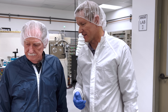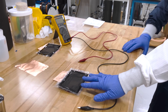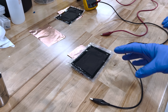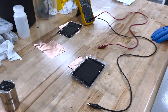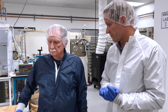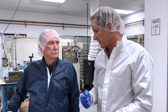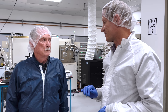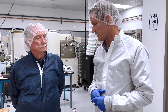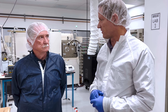When you control the conductivity of the collector layers — not just choosing metal but controlling it the right way — you can avoid violent thermal runaways. We've already done a nail penetration test: we put five cells together, put a nail through it, and the temperature didn't even rise. The voltage went slowly down. On the second penetration, the same again. So we've already proven this concept works — you can build safety directly into the cell.